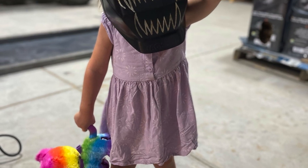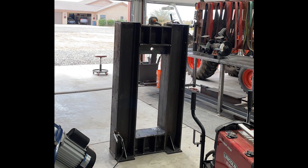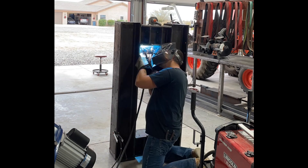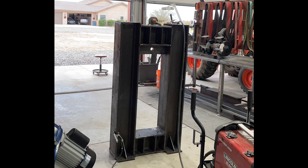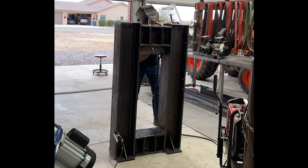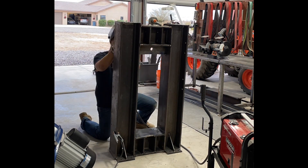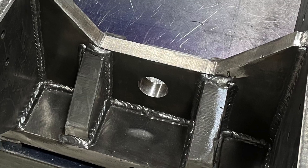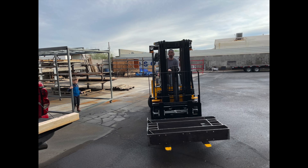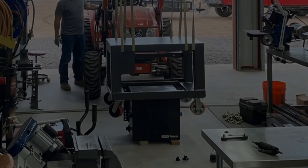I've got my daughter here ready to weld in her fluffy boots. Now I'm just going through all the joints, getting nice big heavy welds on everything. I have so many components built into the H-frame that I don't see it necessary to put multiple beads on one joint, so I'm just running one nice big quarter-inch bead on each joint. Really impressed with the Lincoln 210 MP — such an awesome machine. Got all the parts powder coated and I went with a silver vein color, which is great for hiding scratches in industrial use.